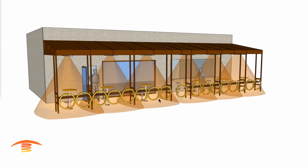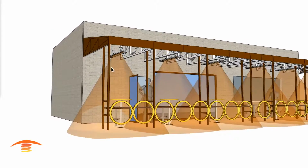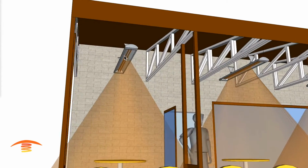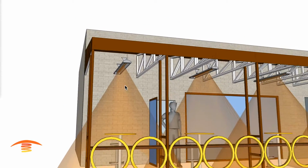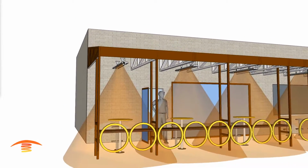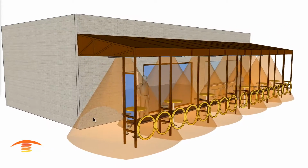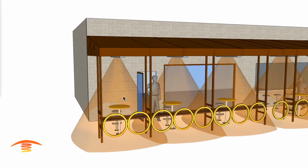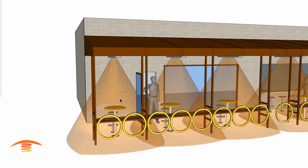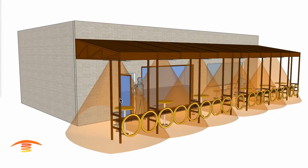And you could use a duplex switch, but I think duplex switches allow the heater to go from one element on to two elements on, which is 50 or 100% on. But 3,000 watts, which is half the 6,000, is probably not good enough most of the time. I think you'd probably use this between 70 to 85% throughout the year. And then on the colder times of the year, you'd go 100%.